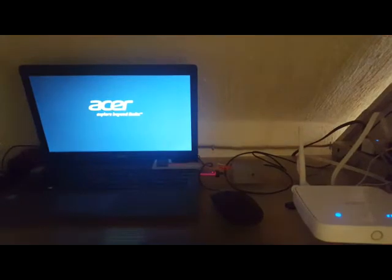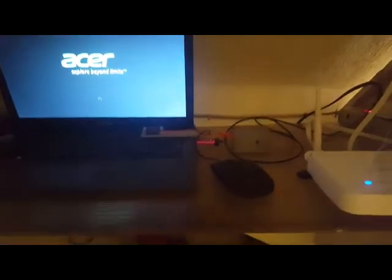And you can see that purple stick that is connected to the USB port. That is a USB to UART converter that connects to an Arduino Nano inside a gray box. And as soon as Windows boots up and executes the startup folder, there is a shortcut to a C# program that runs in the background and starts sending an OK string of values to the Arduino.